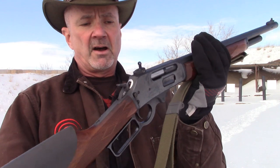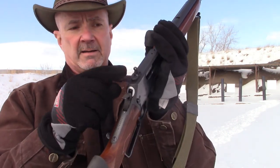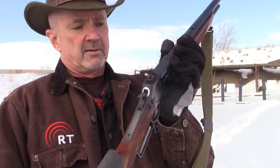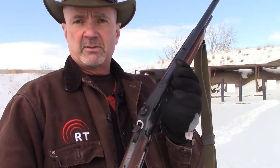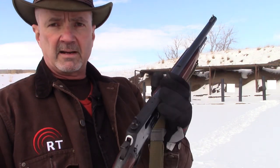Now if you're fine with 100-yard zero, I think it would be about probably 1/8 of an inch shorter in there for 100-yard zero, so that wouldn't be too bad. But I really think the front sight needs to be lower, and then we can get the overall height lower. It's kind of nice that your sight height is only about 1 inch above the center of the bore.